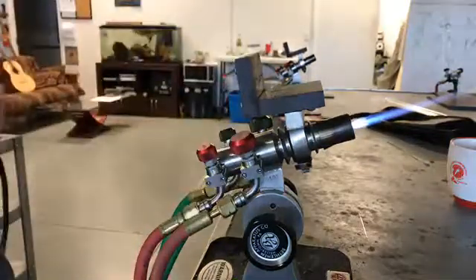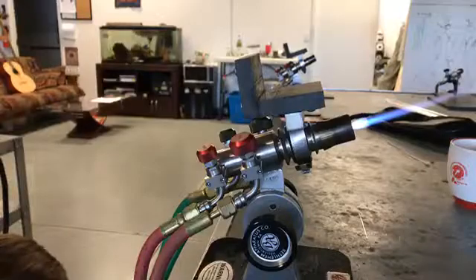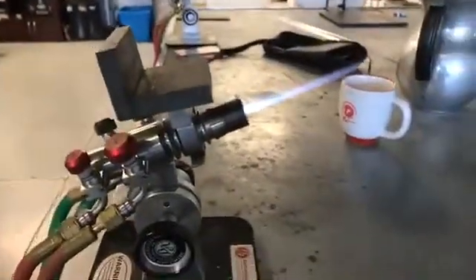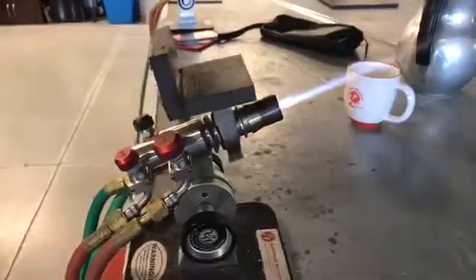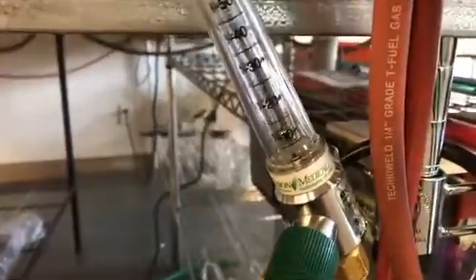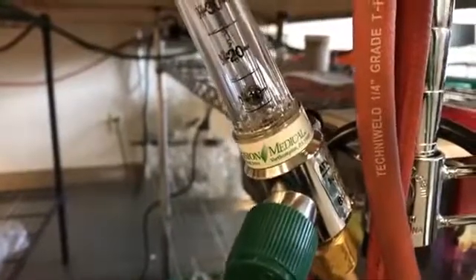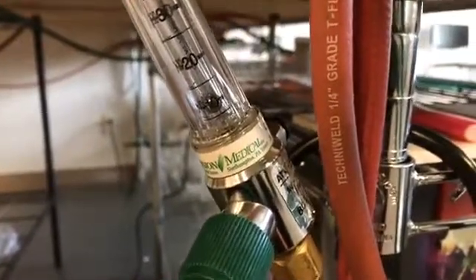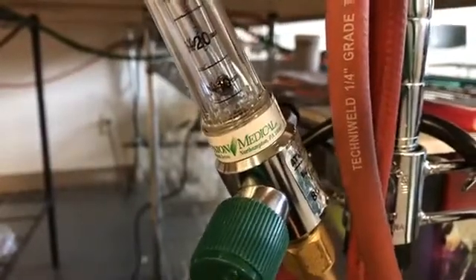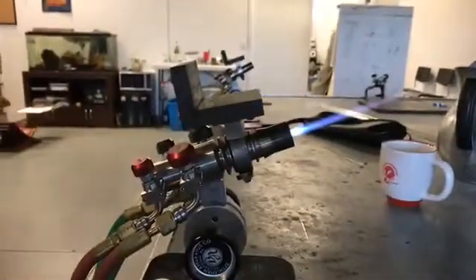Alright, as expected — that guy right there, 10 liters a minute. Come down here and I'll show you. There's the flow meter. It's kind of hard to see but there you have it — right at 10 liters a minute. You're supposed to read the ball from the middle of the ball, so that is exactly 10 liters a minute. It's pretty typical for the Alpha. Let's push it up and see what a top flame for this guy would be.